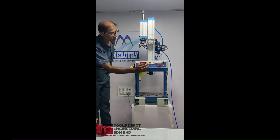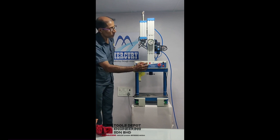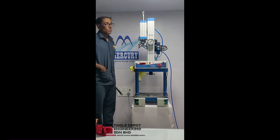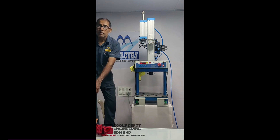We have to operate the cylinder on approach 10 to 15 times. This is done to ensure that whatever air is trapped in the oil comes up, and then we have to release it by opening the top oil fill plug again.